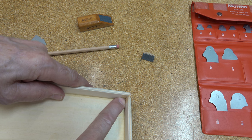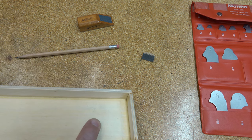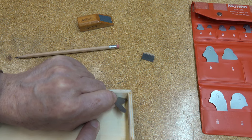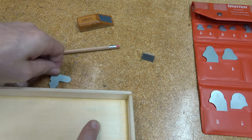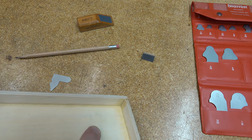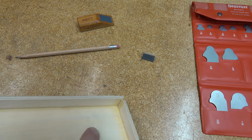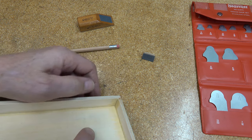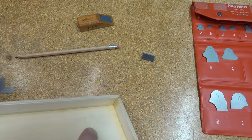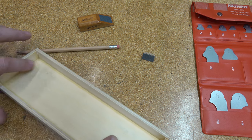Then when you put your goop, whatever it is, Bondo, whatever you need to make a fillet, you simply put it into the corner with just no care and strike it off. Peel your tape. You have the absolute perfect corner without doing any secondary work. If your tape is thin enough, it should just take a brush of a piece of sandpaper and you'll totally lose the edge thickness of where the tape was. Virtually no sanding.